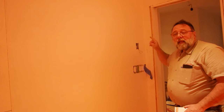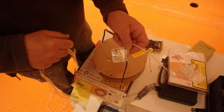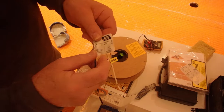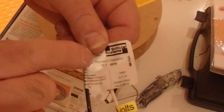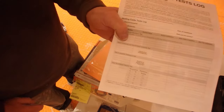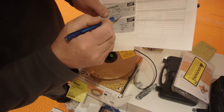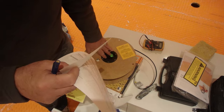The wall connections have to be done by a licensed electrician. There are three versions of this thermostat: this touchscreen version, a standard one, and a Wi-Fi version. There's a label on the unit that tells you the ohms you need to test for — it has to be within 10% of that number. We need to fill out the test log: I've got the factory value of 17.7 ohms written down.